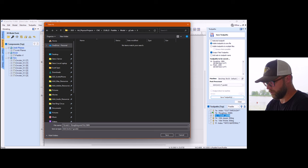Remove the screws from the project material after the carving is done, and the project material itself. Insert dowels, or whatever you're using for index plugs, into the bottom two index holes. You only need the bottom two at this point because there are no holes in the top of the project material yet. That's coming up soon. The project material is lined up with the inserted dowels, and slide amount is double checked against the reference line drawn on the slide guide and the wasteboard. Screw that project material down.